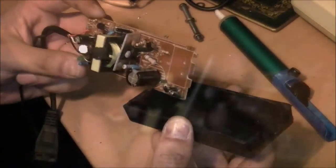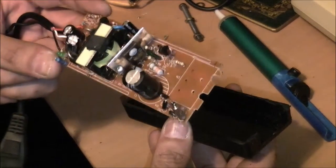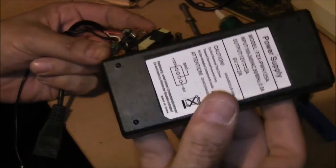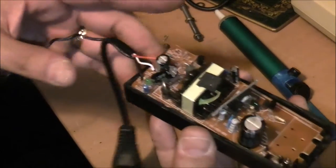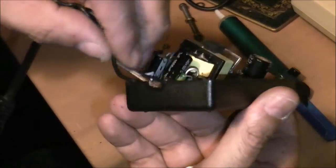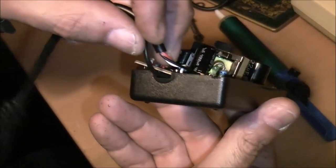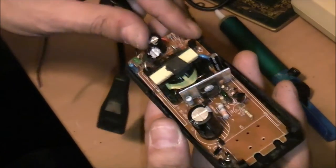So to insulate this board from the bottom of the drive case itself, I'm actually just going to use half of the case that it was originally in. So I'm just going to set it in and hot glue the whole thing down. I will need to cut a couple of notches in here at this end. So we'll do that now, and then we can set this in,